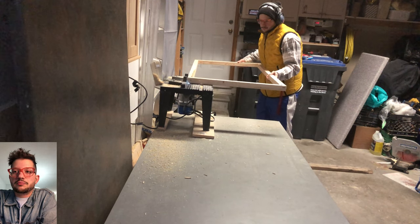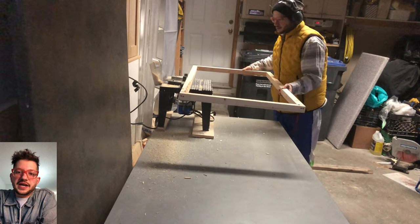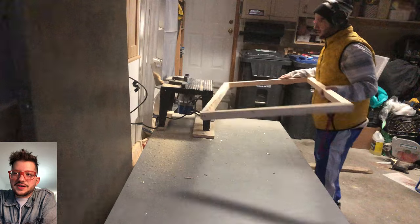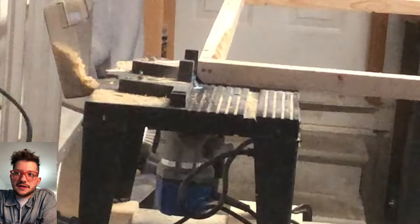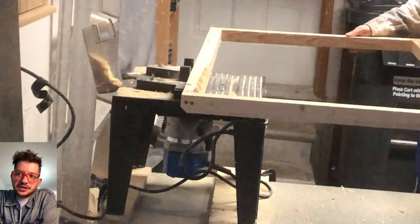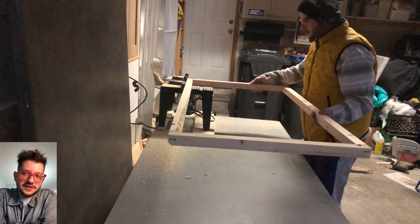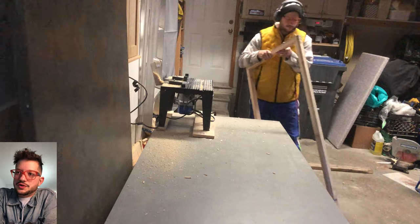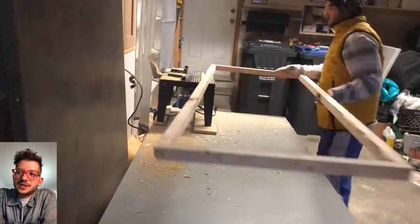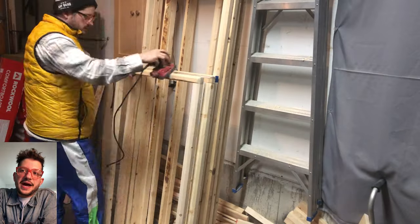Here's a zoom-in angle — you can see the profile that the router gives on these frames. This is what gives us that nice 45-degree chamfered edge on our panel frames. You can see that nice 45-degree edge and the clearance of the screws closer to the rear of the panel so that our router bit does not catch. We do two screws per corner, so eight screws in total for each panel frame regardless of size. I do two passes on every single length with the router.